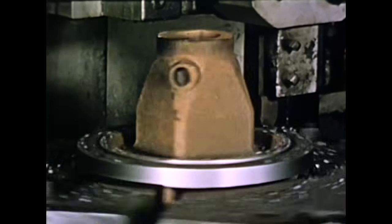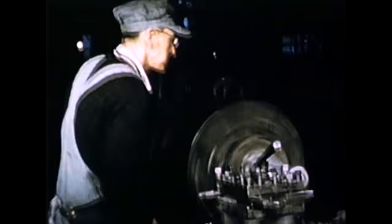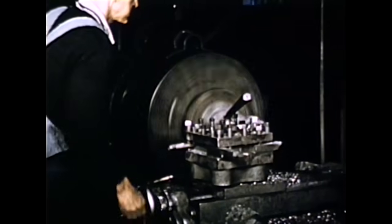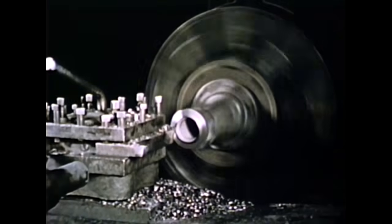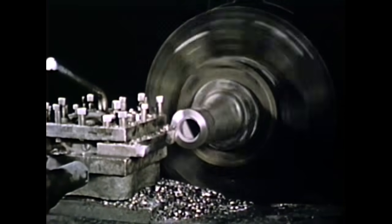The special stress-proof shafts equipped with double-oil seals are supported by 4,000-pound thrust bearings. They carry the high-speed cut steel heat-treated gears, which are assembled to make the heavy-duty gearbox the heart of the rotocycle cutter.